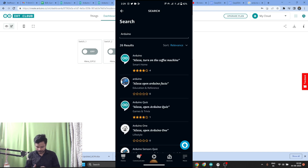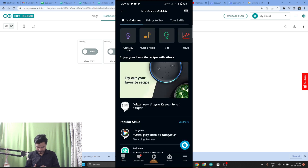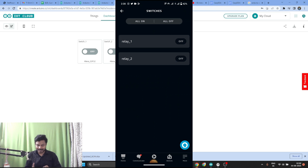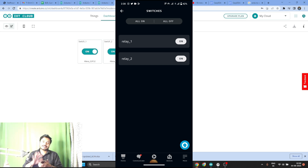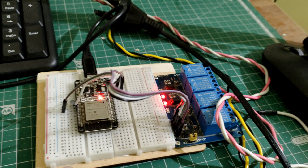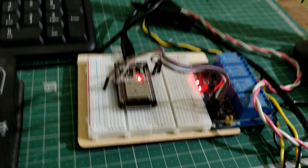Go back, go to the Home section, then Skills and Games, then Devices, and click on Switches. You can see the same variables I created — relay_one and relay_two — are added here. I can also turn on the light using the relay from the Alexa app. You can see the light is on — I can turn on lights directly from the Alexa app. It's that simple.